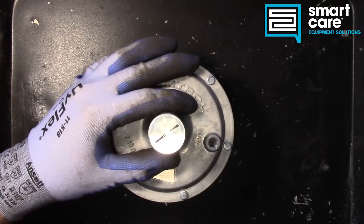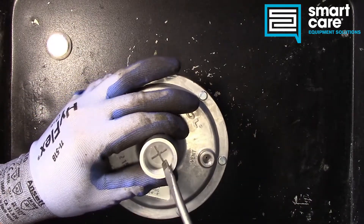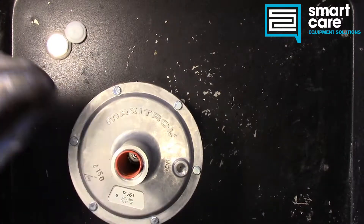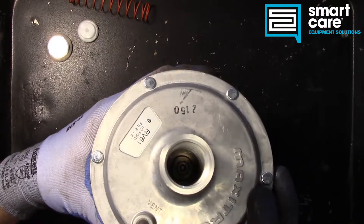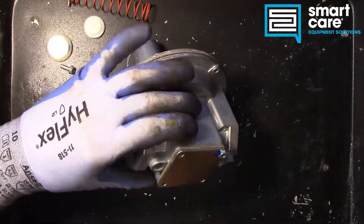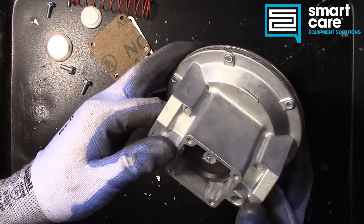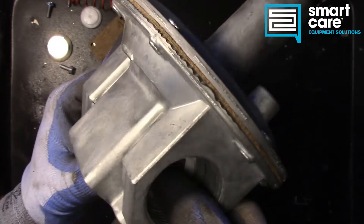Let's go ahead and get the cap off here. We know from experience that inside there will be another adjuster — that's just the cap that we pulled off — and there's probably a pretty good size spring underneath this. There's our spring adjuster and there's our spring. If we look down in there you can see the top of the diaphragm. Looks like we can also get this cover plate off — let's do that before we knock the rivets out. You can actually hear the vent whistle as we move in and out.